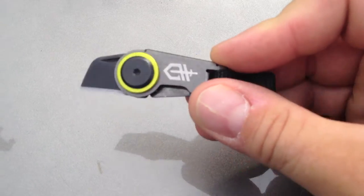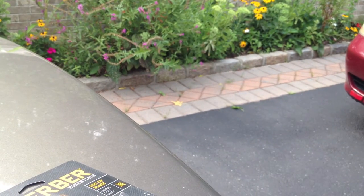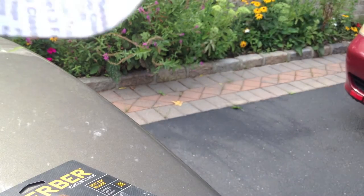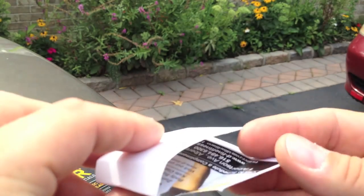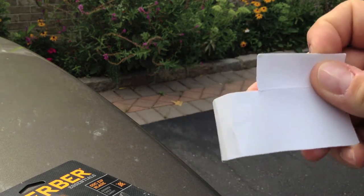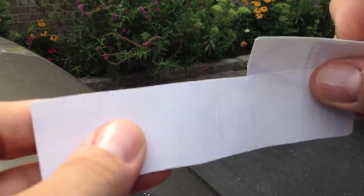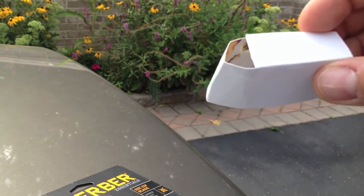I made a little mock-up here to show how it's constructed. It looks solid, but it's actually sheet metal folded over — you can see the bend, a little circle on one end and on the other end. It's a flat piece that was bent and folded over, and that provides the structural rigidity. Once this is bent over it becomes much more solid — without it, it could flex in that direction, but with it, it's very rigid.